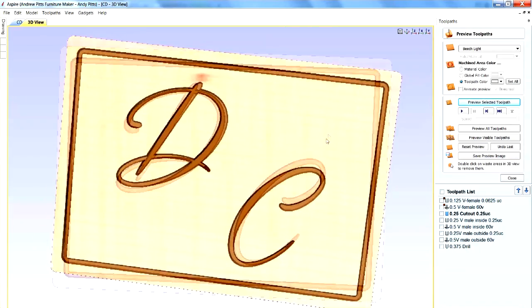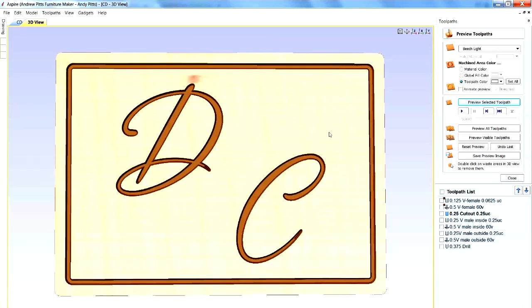Now, when I did the inlay part, I actually cut deeper than the depth of these letters out in this waste area, so that I wouldn't bottom out on the waste area. I want to bottom out on those letters, so I actually cut away another 1/10 of an inch from the waste area. So when I clamp this up, these letters should bottom out really nicely and I'll be in shape. So let's go ahead and prep the wood and set up the ShopBot to do these cuts.